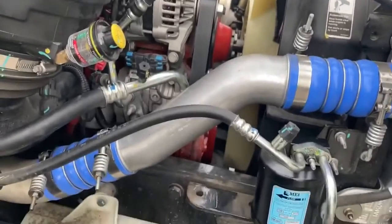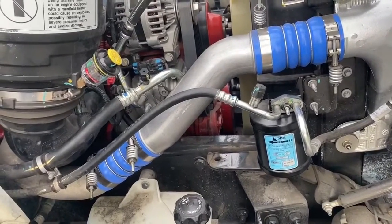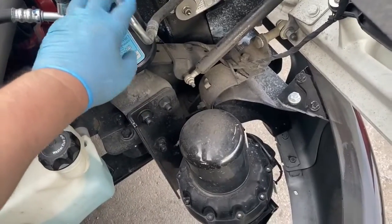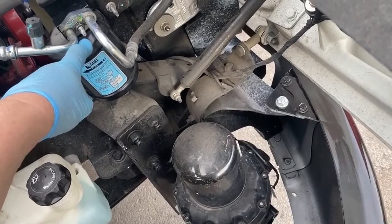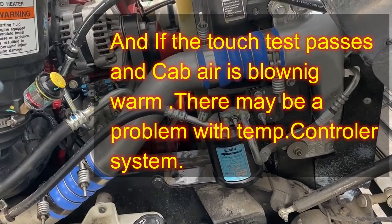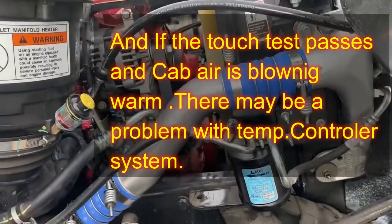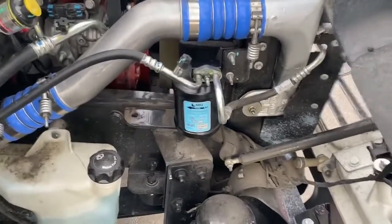So when you do that, it's just basic checks — by touch and visual. You want to look for oil around. For instance, if it came out hot right here and then it was really cold here and this was iced up, that would mean there's a blockage in here — it's basically acting like an expansion valve. When you have a really high restriction inside this, that means you have a problem there. Or if the pressures didn't feel that hot right there and it was coming out warm but not that warm, maybe you're low on Freon. Or if it's not that cold at all coming back out, it just gives you a little visual idea of how things feel and whether everything's working right.